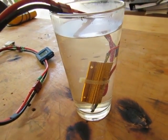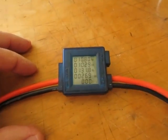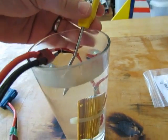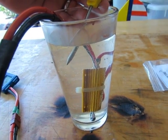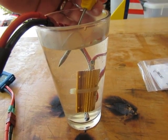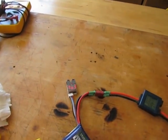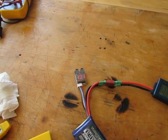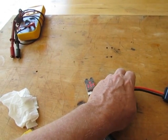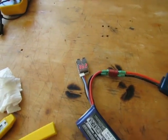It's drawn 26 watt-hours so far — a fair bit of energy. It started off as a full glass of ice water and it's now up to 122 degrees and counting, so it's really quite warm. That alarm means one of my cells has dropped below 3.3 volts, so we'll stop the discharge. Of course, voltage jumps right back up after stopping.